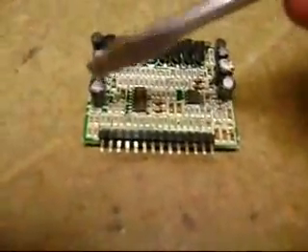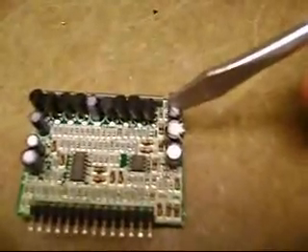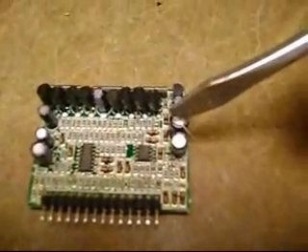So what we're going to replace is all seven of the electrolytic capacitors on here. This is C4 — 10 microfarads, 50 volts. This is capacitor C8, 1 microfarad at 50 volts. This is capacitor C9, also 1 microfarad at 50 volts. This is capacitor C11, also 1 microfarad at 50 volts. This is capacitor C27, 4.7 microfarads, 50 volts. Here's C24, 33 microfarads at 25 volts. And finally, capacitor C18 — 10 microfarads, 50 volts.